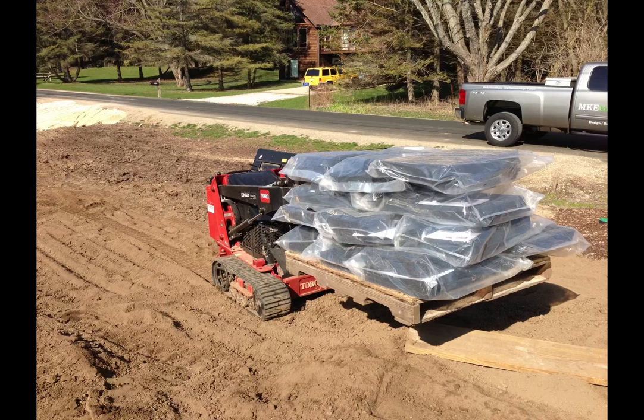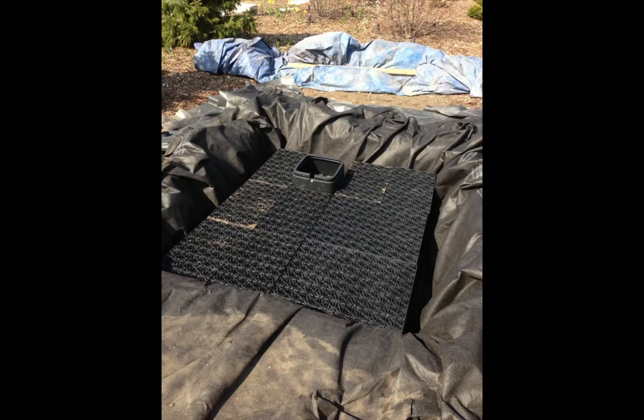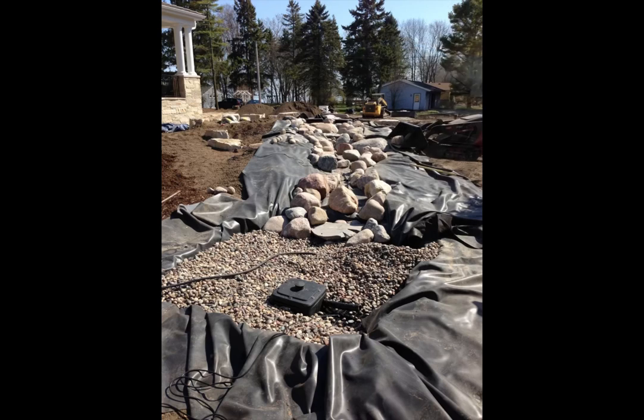A pondless reservoir stream is powered by a holding reservoir. These are basically high-tech milk crates that you assemble after calculating how many gallons you need in the reservoir. We've dug the reservoir out here — you can see the milk crates assembled. Just stack them in there, put the snorkel in there — that's the one with the hole on top — that's where the pump will sit. Obviously there's a rubber liner underneath, and underlayment underneath that.